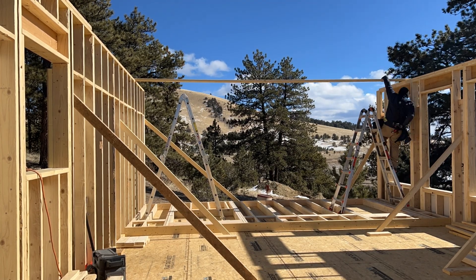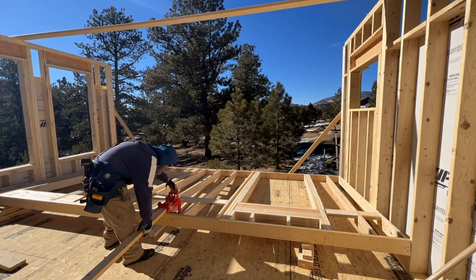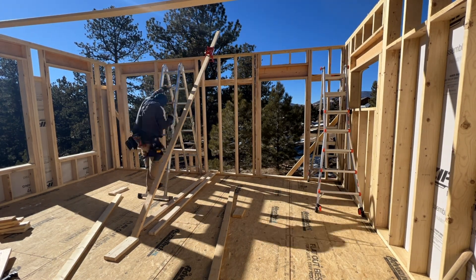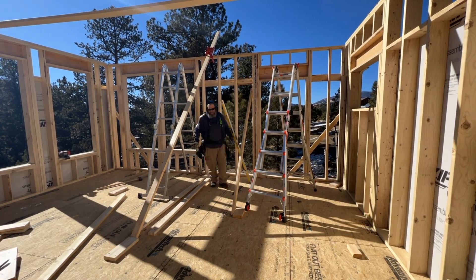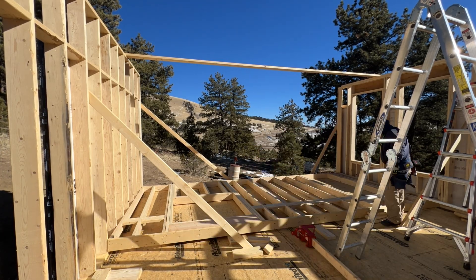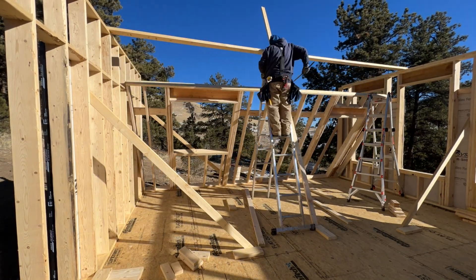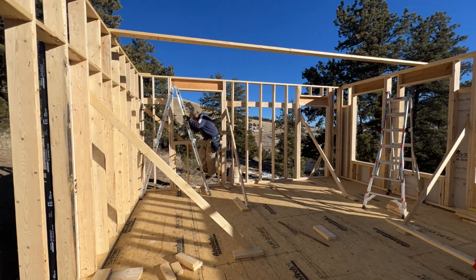Here I am putting a little brace up because I took a couple of the braces out. Now it's time to raise the wall — it is ready to go, and that brace was in the way so I had to move it. Had to give a little shimmy on those sidewalls to get it up and tacked in place. Then I had to go do the other side, making sure I got the blocks up. I figured out you have to go four or five layers of blocks up to be able to get the jack in on that pole to lift it. Getting that other side braced in and one, two, three — we're all done.